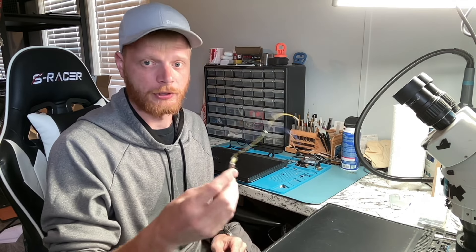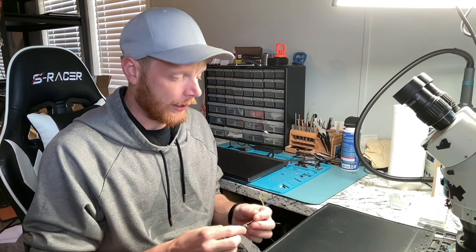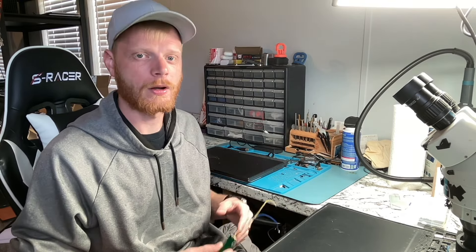I did a continuity check from the PS5 where the cable was attached to the actual adapter and I was getting like 0.150 in diode mode, which is not a good connection. So what I did was simply solder wires right to it. I checked again and got 0.00 which is good — that means good continuity — but it still didn't work. I was doing a couple of different things wrong, and that's why I wanted to make this video to make it easier for you guys.